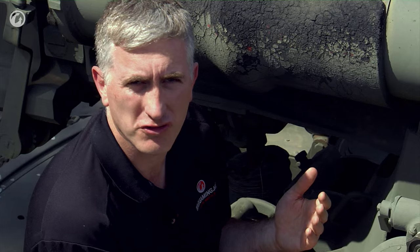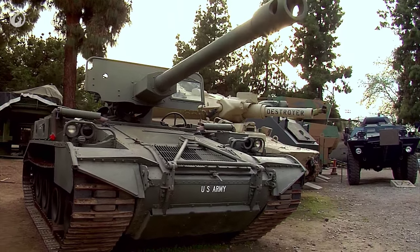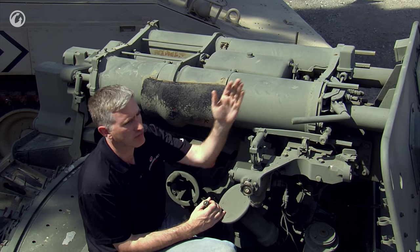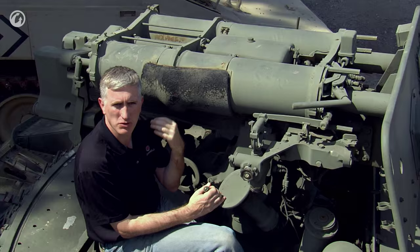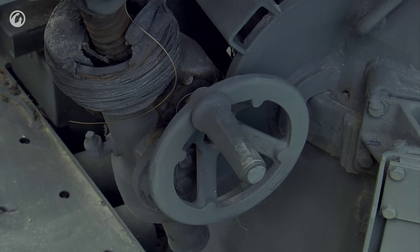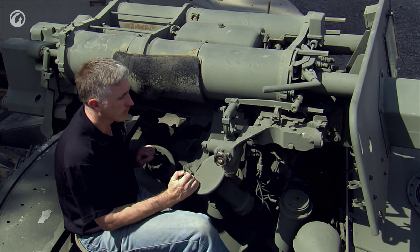To get going with the gun, you first want to clear it for action — remove the canvas shrouds covering the ammunition, the breech, the optics, and the counterweight. Early T101s had a T-shaped blast deflector; production models had a simpler counterweight with a hole drilled on each side, as on this vehicle. There is a manual safety on top of the gun — a simple lever. Next, you want to prime the recoil cylinders using this hand pump, pumping it backwards and forwards; there's an indicator on the back that protrudes depending on how much pressure you have. When loaded and ready to fire, remove the mechanical safety. There is also an electrical safety switch. The gunner aims by use of the elevation hand wheel and traverse hand wheel — 30 degrees of traverse per side, 15 degrees of elevation, and a solid 10 degrees of depression. When you hit fire, you hold on for dear life.